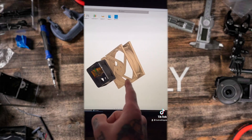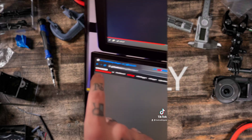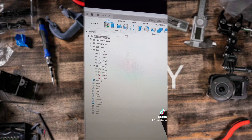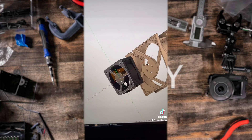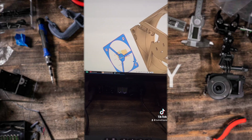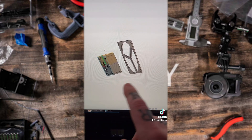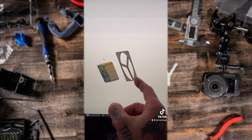Now I'm in Fusion 360 and I've already pulled in models for a 50 millimeter fan and an 80 millimeter fan, both downloaded from GrabCad — a place I often go to get pre-rendered 3D models of things like fans or motherboards that I'm designing around. With those pulled in, I'll create a sketch on the face of the 50 millimeter fan, extrude it up 20 millimeters, then repeat that process on the 80 millimeter side. Now you can see the two halves of the adapter going from 80 millimeter down to 50, and I'll show you how I make a funnel to neck that down from one to the other.